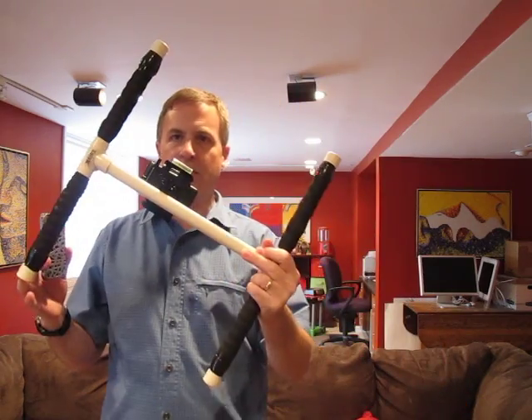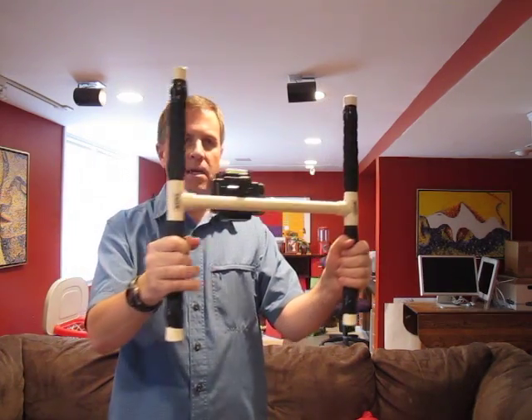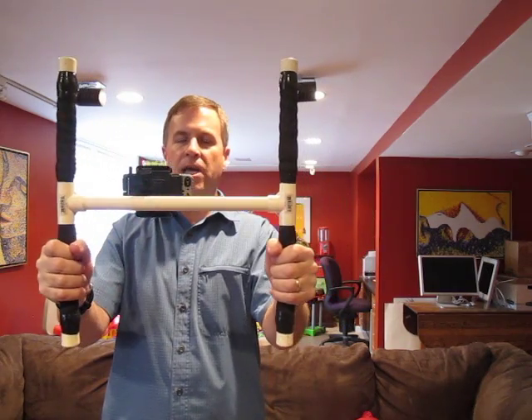I said we were going to go outside and take some video, but it's very windy and blustery, ambulances were going by, so I gave up on that and brought you to the kids' playroom instead. What I mentioned earlier was I was shooting video at the Christmas parade for my kids' Cub Scout pack, running around with this phone, shaking it, scared I'm going to drop it, always worried I'm going to put my finger in front of the lens just like my mom always did. So I thought there's got to be a better way. I found a couple of ideas online about how to put together a steadicam, or what I've been calling an image stabilizer, and we came up with this H. You lock in your phone, hold the bottom handles, and just pan around — it reduces shake and makes it so much easier.